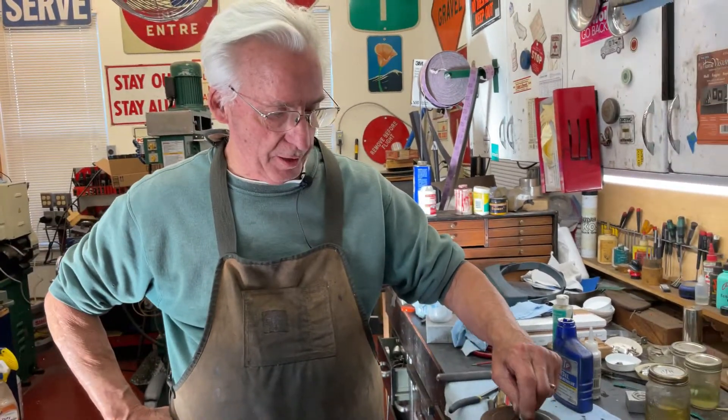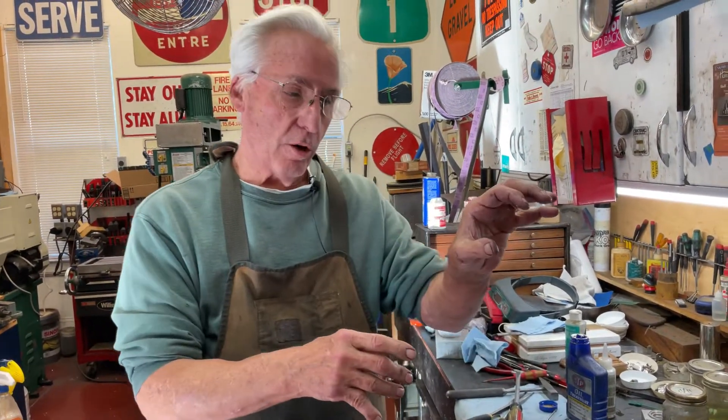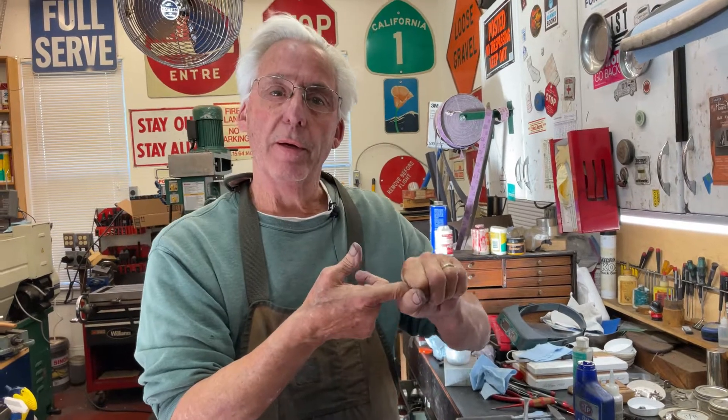And this is how you put one together. You're going to have to take this back off because the gear is going to come down on top, but this is how you do it. You always want to crush that a little for the arbor so it's kind of tight and it clicks in place on the pear shape. Clip clips are much easier, like on Victor. And that's my tip for the day.